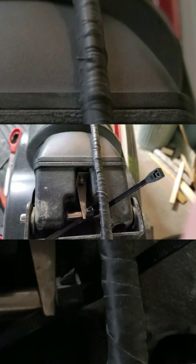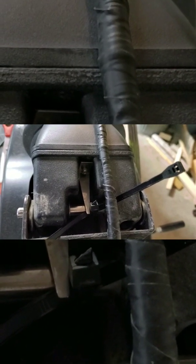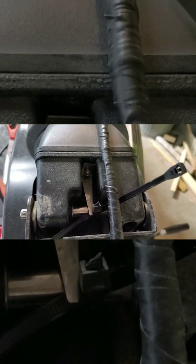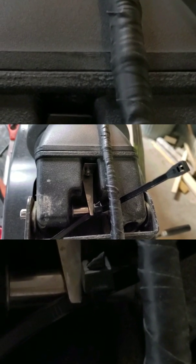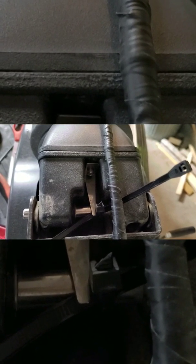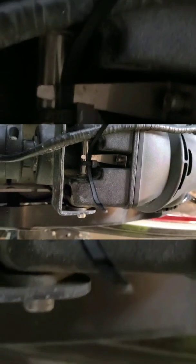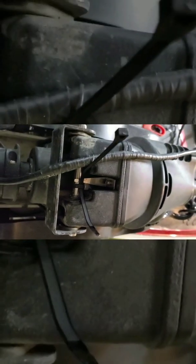So what we have here now is I put one zip tie on the inside of that shaft and another zip tie through that first existing zip tie to allow the cable clamp to flex and turn to the correct location for the transducer cable. You can see I removed the original cable clamp from the 3-in-1 cable, and the reason why is I had to reposition it because I had to fit 2 cables through now. Okay, so I got the zip tie around the shaft there of the mounting base, another zip tie through that, and the next scene I'll show you with the cable clamp on there.